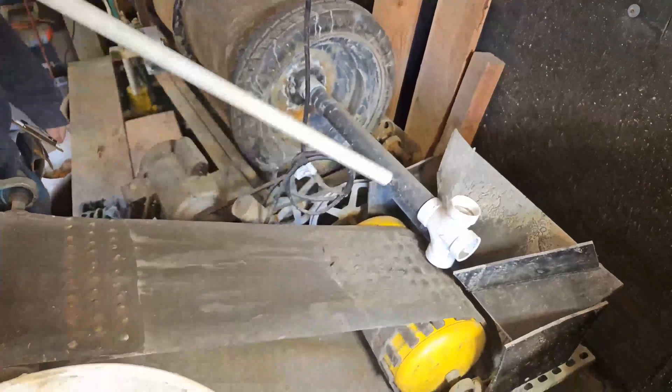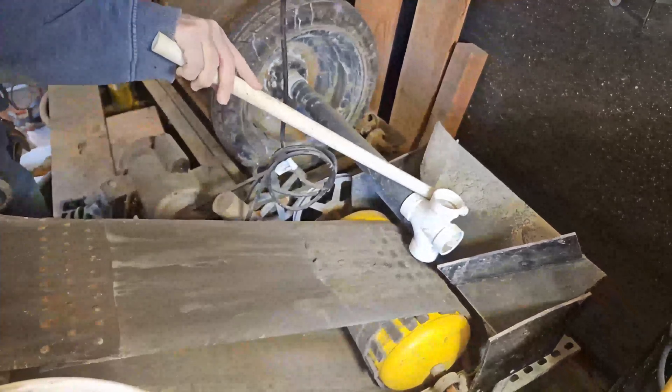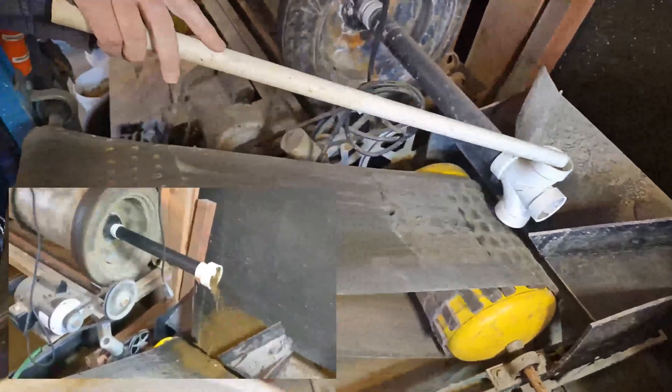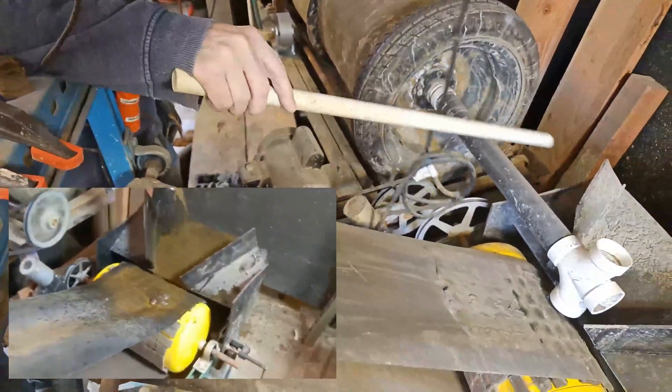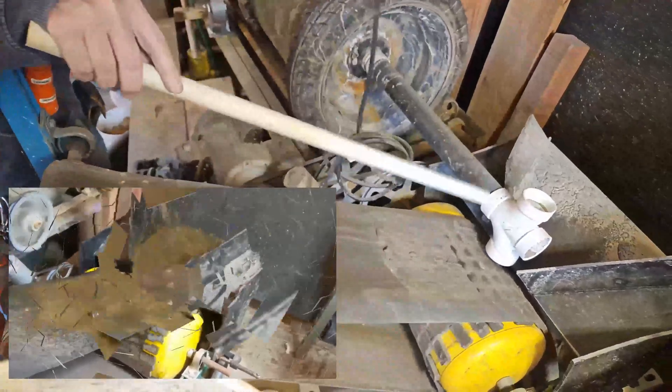Because this is the lower end, we welded on a pipe fitting and then PVC pipe fittings. It comes down to this fitting and dumps onto this tray. This is a magnetic separator — we'll describe that in the next video. The liquid and sand flowing through the tank washes all the small ground up particles right out onto this. Works real well.